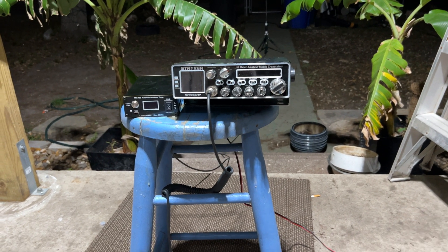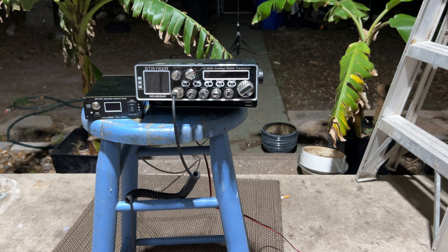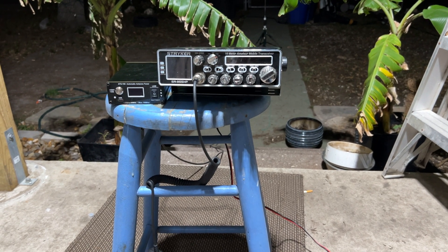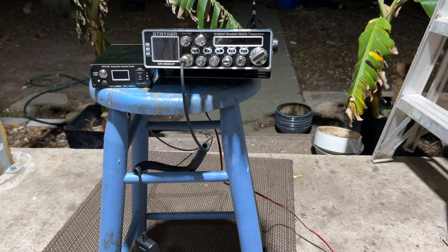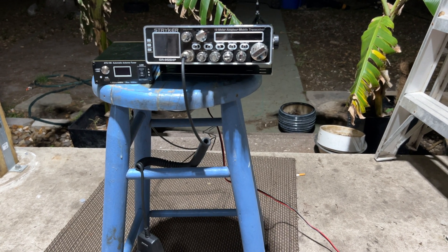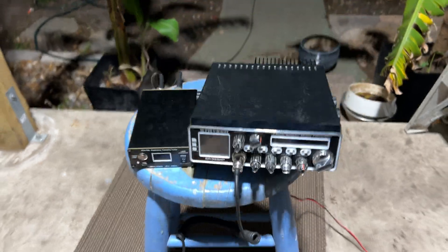361 Corpus Christi, Texas. It's probably about five in the morning right now, Texas time, and it's a great time for the channel. I have now got the SWR on the homemade coil down to 1.5 — a range between 1.4 to 1 and 1.8 to 1 — and with the tuner I can get it down to 1.04 to 1.06 to 1. Tonight is a great night. We got the power supply, the Striker, and the ATU-100 tuner.